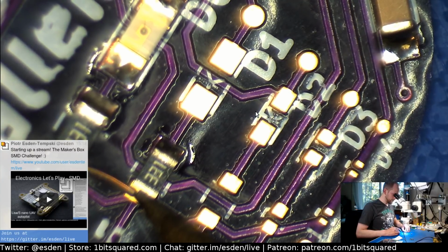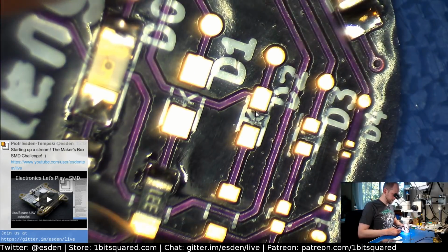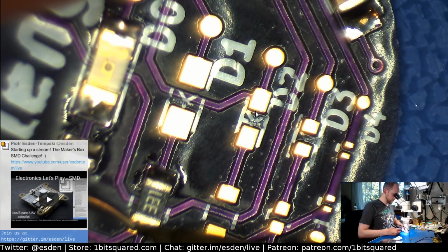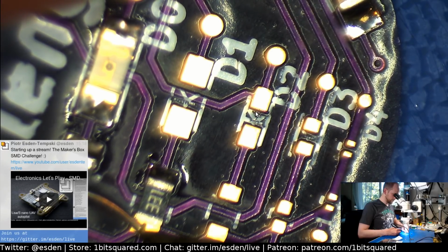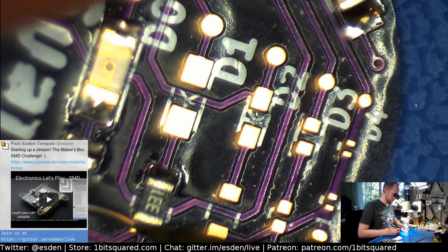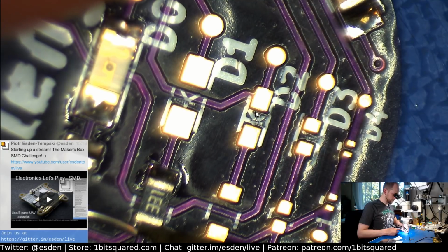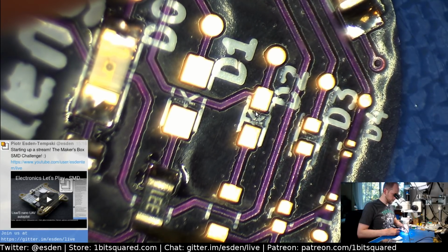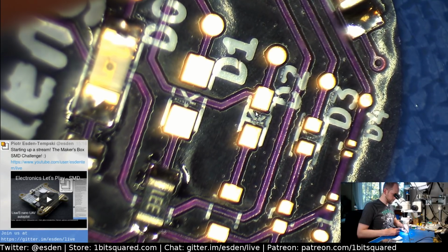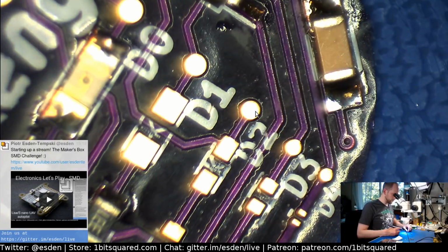It's still very forgiving because, as far as I can tell, Ken, I think that's his name, who made that kit, he decided to use KiCad footprints that are for hand soldering. So they are longer than footprints for just reflow oven use.